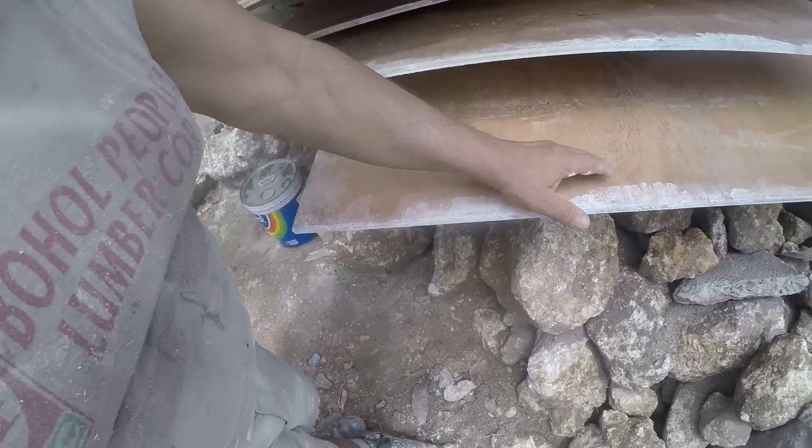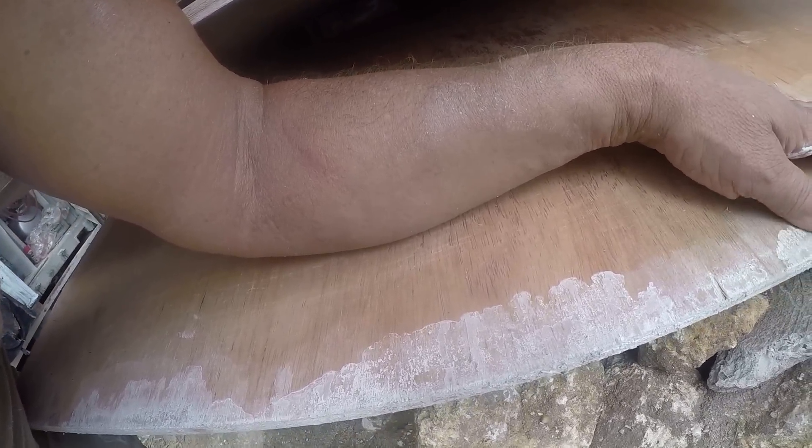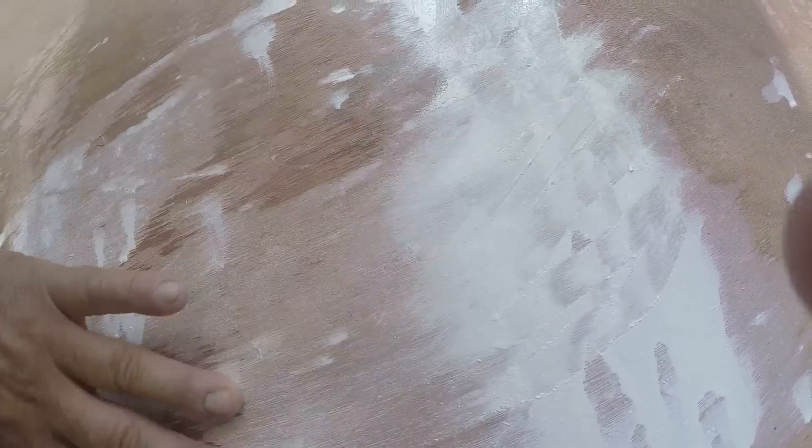The Chinese plywood is a thousand pesos for seven-sixteenths. So this is what you get in the Philippines. I'm painting all the plywood — every piece — with an oil-based paint using turpentine as the thinner, one coat. Then on the side where the concrete goes on the form, I'm going to paint it with a latex paint as a second coat, then spray it with form oil so it doesn't stick.